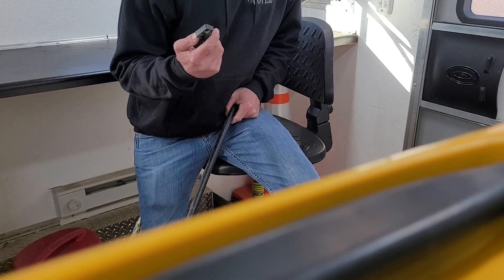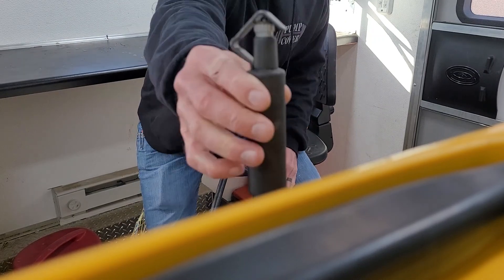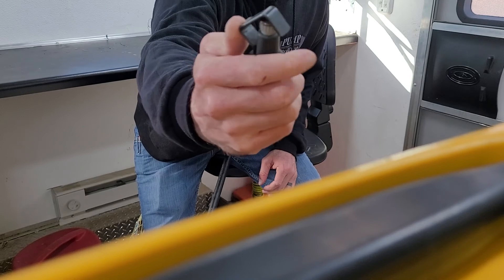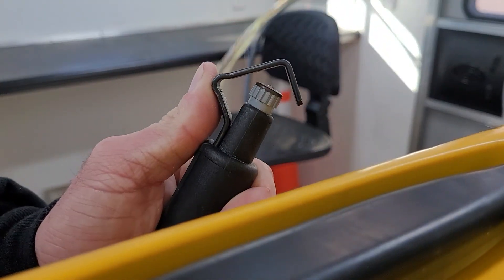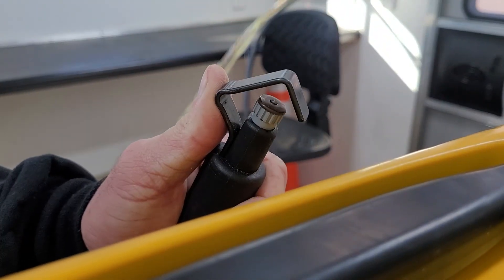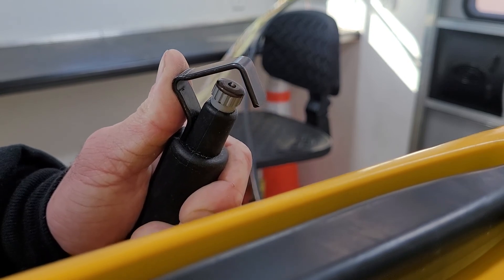You use this same tool. To do a ring cut, there's a way to shift the head on this tool. That raises up and the cable goes between there and puts pressure on it against a little tiny blade. See that little blade in there? You can actually set the depth of that blade depending on the cable you're working with.